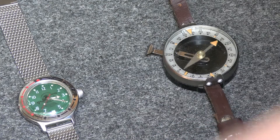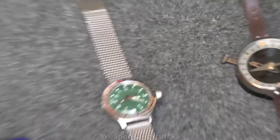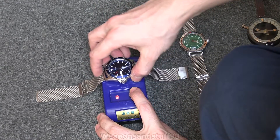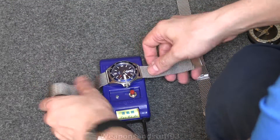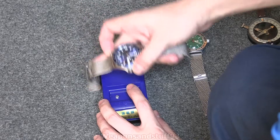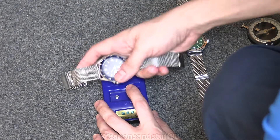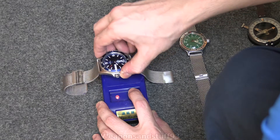What I've got here is one of those cheap degaussers. I've had to use it before. The idea is you hold the button down and then slowly lift the watch away from the magnet and repeat a few times. It's meant to demagnetize the watch. Hopefully if this works, we do it a few times, wind the watch up, and it might start working properly again. At the moment the watch will randomly start sticking or lose five to ten minutes per day, which is nowhere near the accuracy range this watch should have.